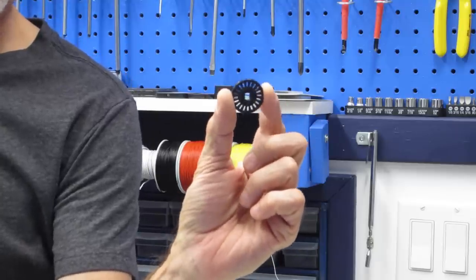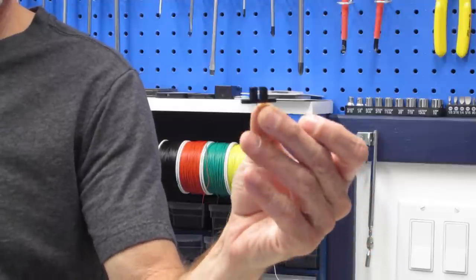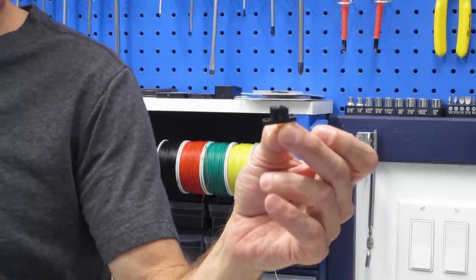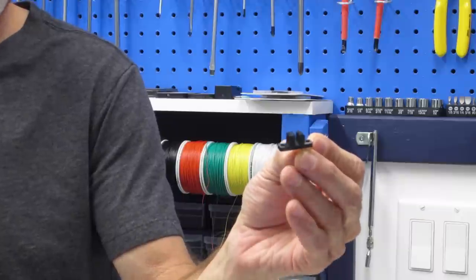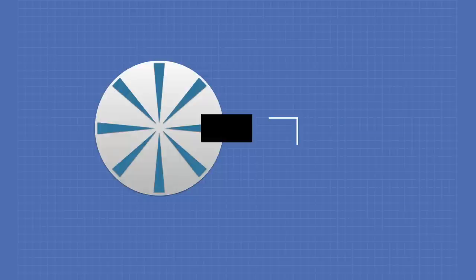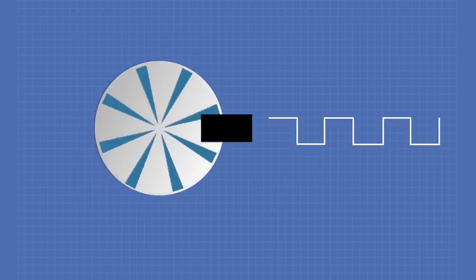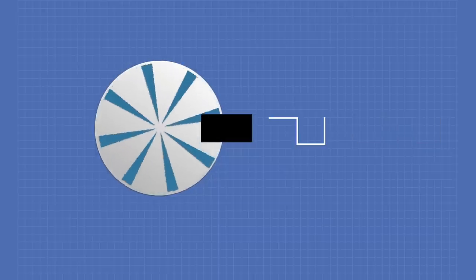Now that we've put together the car base, let's discuss this small disk that comes with every car — it's the key to sensing wheel rotation. The disk has a series of slots — this particular disk has 20 slots. It's meant to be used with a component called an optointerrupter, which is simply an LED and a phototransistor mounted with a gap in between so it can sense when something passes through that gap. The disk is inserted in the gap and as it rotates it interrupts the light beam. As the beam is interrupted, the phototransistor will sense and not sense the light, producing a series of pulses. If the disk rotates faster, the pulses come faster — we can use this to measure disk rotation and speed.